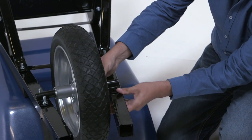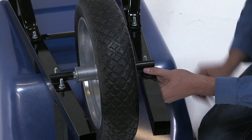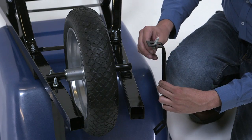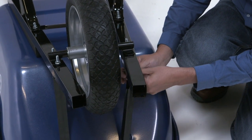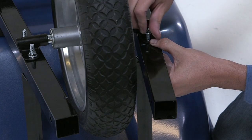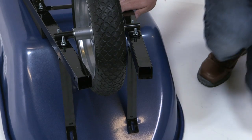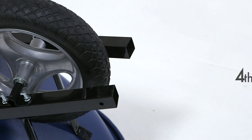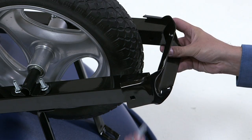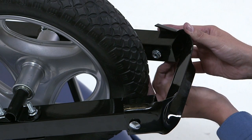Remember that you still have to do all of this by hand only, without tools yet. Use your last two two-and-three-quarter inch long bolts to put the second tray brace and secure the second axle bracket at the same time. All threaded ends of the bolts must point towards the inside of the wheelbarrow, away from the user. Now it's time for the wheel guard — simply attach it over the front of the handles using the two-and-a-quarter inch long bolts. Again, the rounded heads of the bolts must be placed outwards.